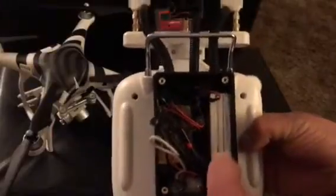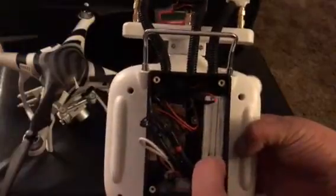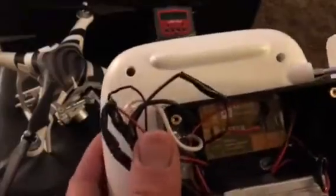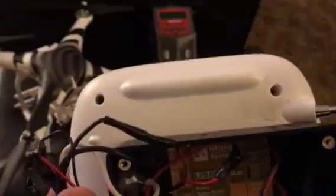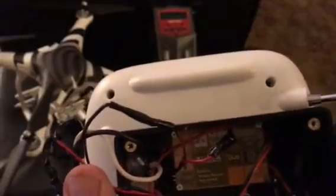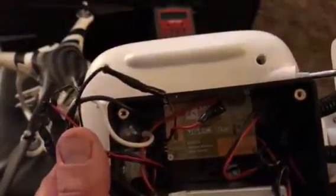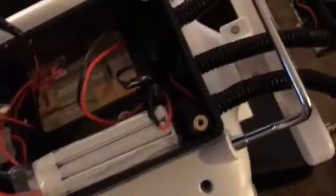Here's your LiPo battery — this is a three-cell 11.1 volt, 650 milliamp-hour. Behind the wires here you'll see the BEC dual output. Again, it has one 4-amp 5-to-12-volt switched output that you can set at 12 volts for the 5.8 gigahertz amp, and a fixed output for the 2.4 gigahertz amps.